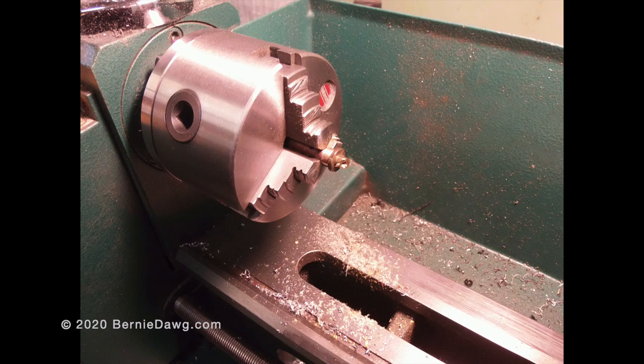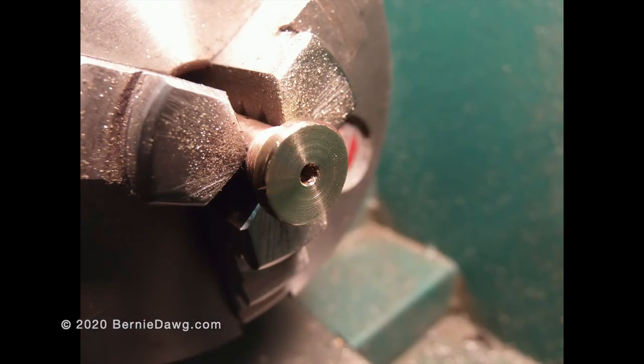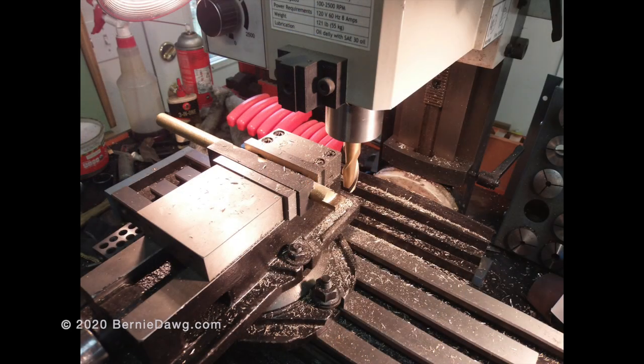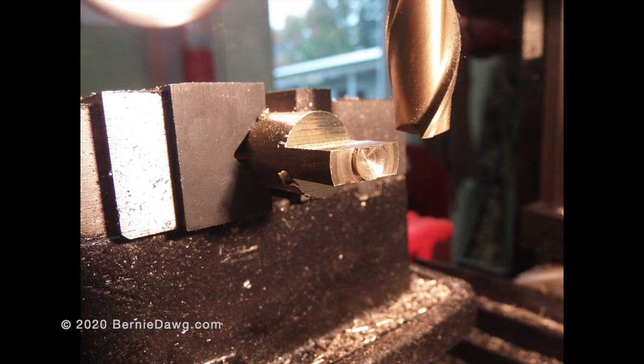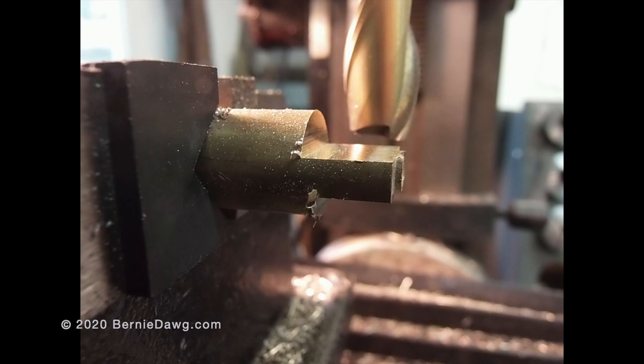It did eventually come out. NRVs are pretty common these days and easily replaceable, but for no rational reason I can think of, I decided to rebuild this one. I machined the head of the NRV so it was flat again, and then used the vertical mill to machine a five millimeter thick chunk of brass that I could use for the new head.